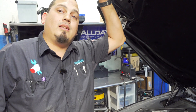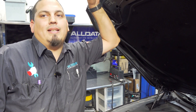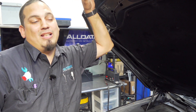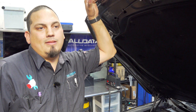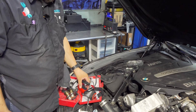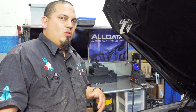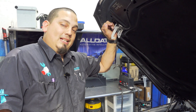Also, you're not supposed to activate these solenoids for a long time — just a very short period. They're not designed to withstand extended periods of activation. You'll burn it out, or you can burn out the transistor that's driving it. Anytime you've seen a computer hold down a coil or activate something for extended periods, it doesn't end well for the transistor.